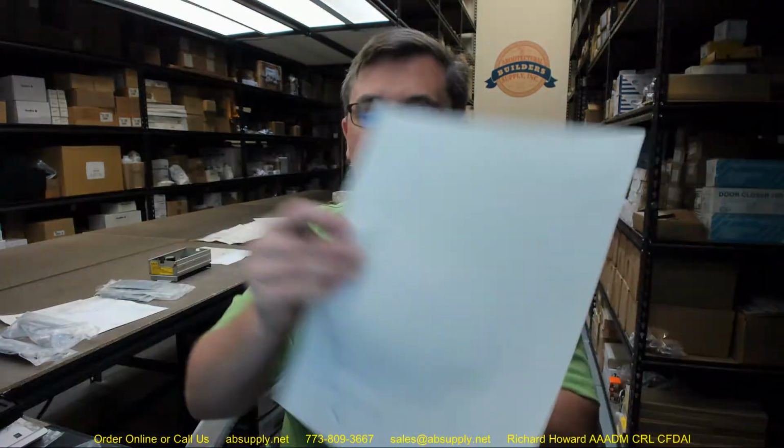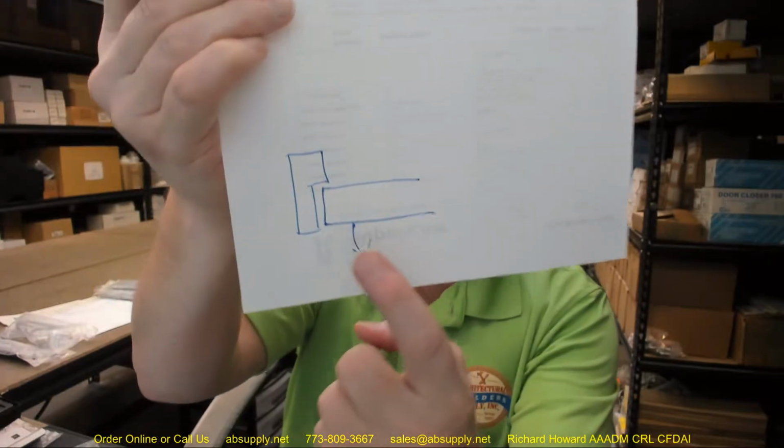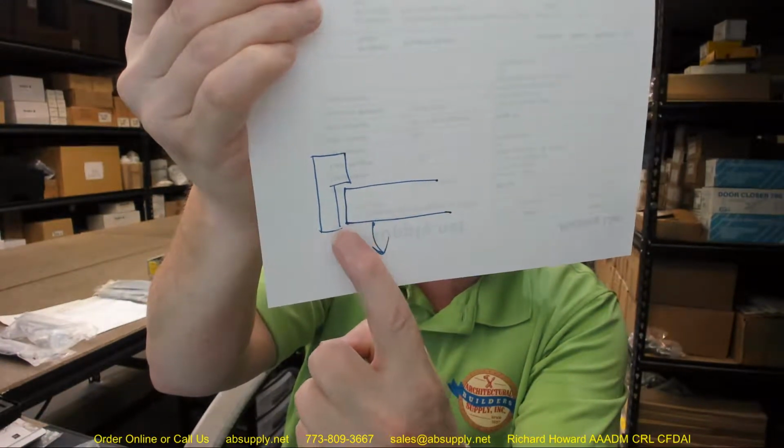This may also be used, or this concept is also used in doors that are center hung, and they would obviously swing in one direction where you need to have a greater offset to account for that. So a standard latch guard is going to work obviously where you have, I'm just going to make a quick sketch here, an application just like that. Okay, nothing unusual about that inside of the door. It's just typical. It could be flush, or it could be inset ever so slightly.